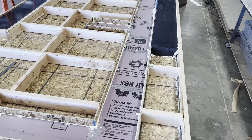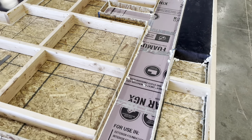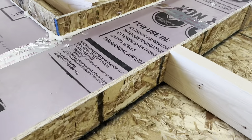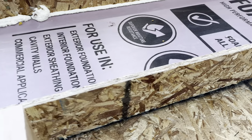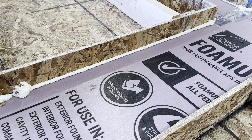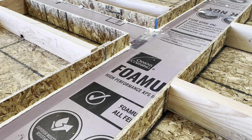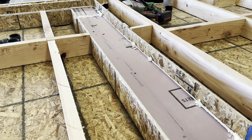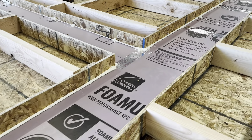Here's a look at one of our camps that we're just getting ready to get the floor put on. As you can see, we've got our ductwork that runs all the way up the camp. This is set up individually for each camp so that you get the best airflow possible. We've got our three-quarter inch foam board and then a quarter inch air space below it for extra R-value to keep that air warm as it circulates through the camp. A lot of your heat is going to be lost through your floor and ceiling, especially if you're not skirted.